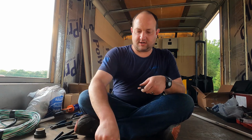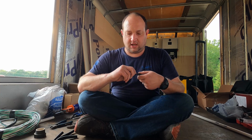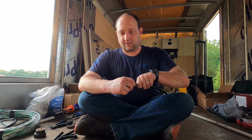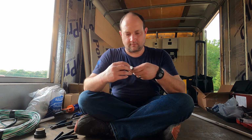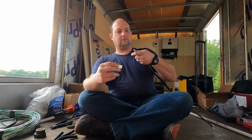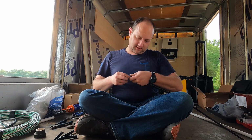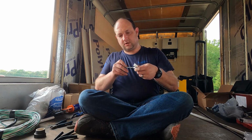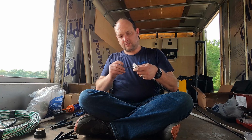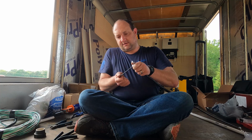So now you're kind of to your bus bar. Anytime you're making an electrical connection with stranded wire, you want them twisted. And of course they're twisted in this wire already. So when I stripped it earlier, it's already there. So you don't want anything sticking out the back side of the bus bar. You want the plastic right up to it. Gonna run this down till she's snug.